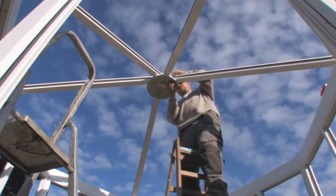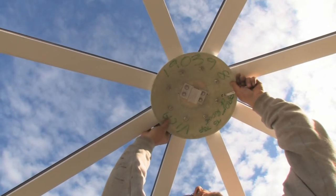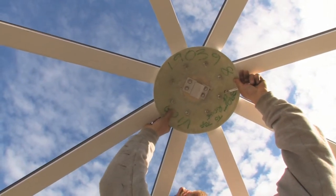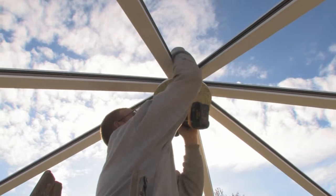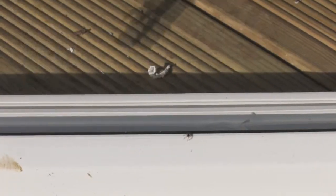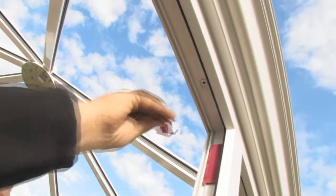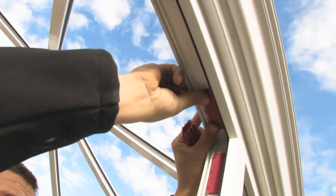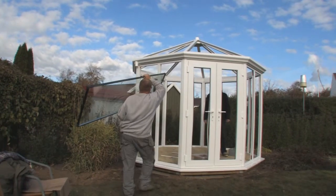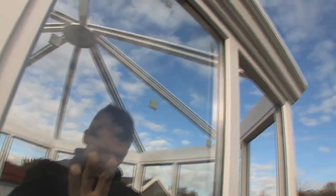When all the rafters have been positioned, check that all of them are flush diagonally. If so, secure them completely. Now join all the screws at the bottom of the element and position glazing blocks. Mount the glazing units. Use a rubber hammer for the beads. It is important to wedge up the unit in all 4 corners.